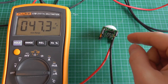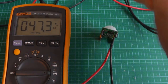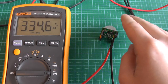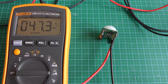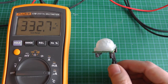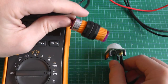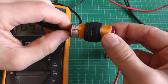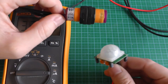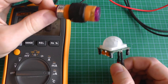I want to use this module because in its idle mode it only uses around 50 microampere — that's not a lot. And when there is motion it will use 330 microampere. That's a lot less than the 30 milliampere we've seen for the infrared range detector. So what I will do is use this motion detector to see if there is motion, and once there is motion I will switch on the range detector LED for a short time. If there is no motion, there is no cat — and if there is no cat, there is no need to verify if the cat is in front of the fridge.